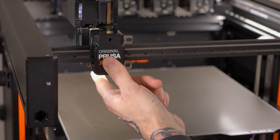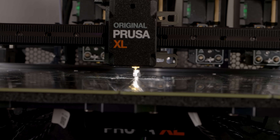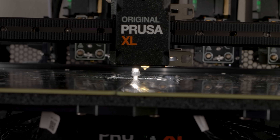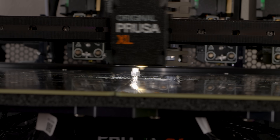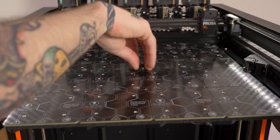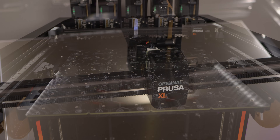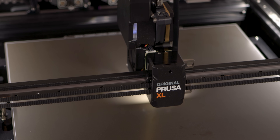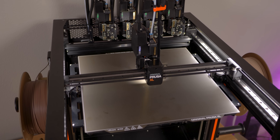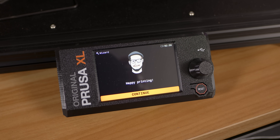With each of the dock locations saved, it's time to move on to the next important step: locating each of the nozzle positions relative to each other. If that's not right, your prints are just going to be layer-shifty all over. It uses a little metal stud in the middle of the segmented bed to locate that position for each of the tool heads. It's not a quick process, but it's integral to proper operation. The final calibration step is a totally hands-off one — phase stepping — where it moves the X and Y motors back and forth to dial them in and reduce noise and vibration. Then Joseph pops up to wish us happy printing.